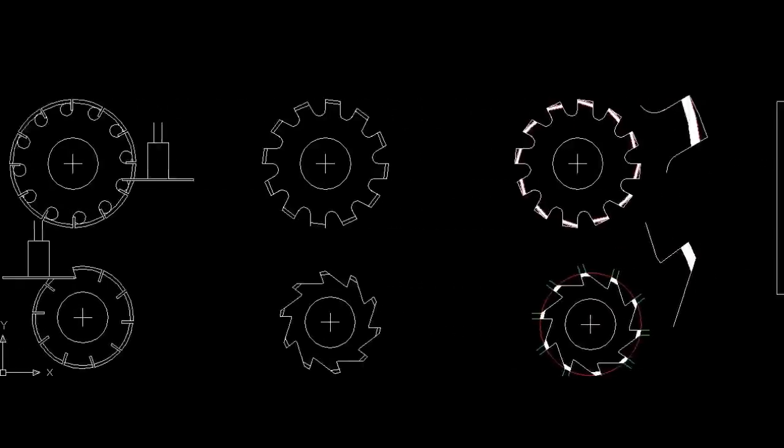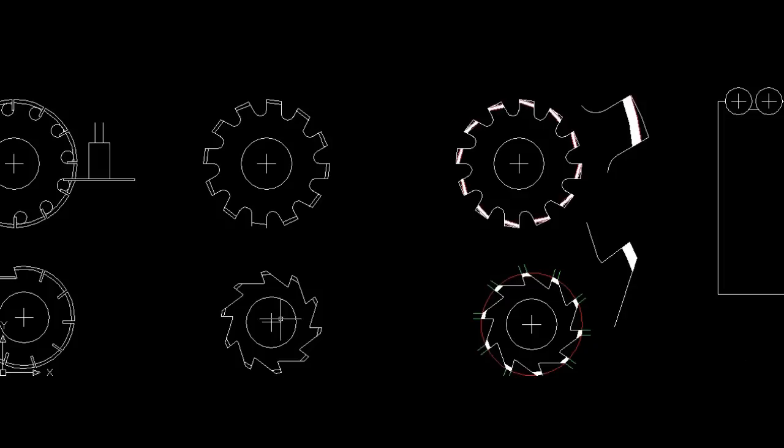Now with Porter's tool, I'm completed here. I just go in and harden it and everything like that. But you can see this red line here, that's the circumference of the tool steel. And you can see that in between these green lines, that part is still there. It's right here in this blow up of it. And that actually rubs when you're doing the cutting because there's no relief there.